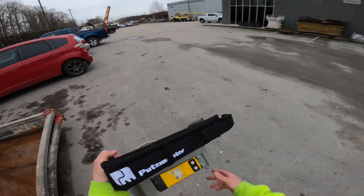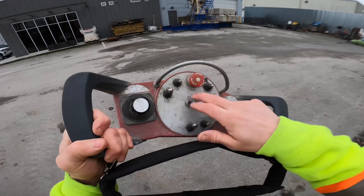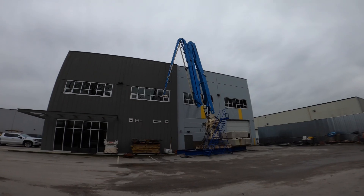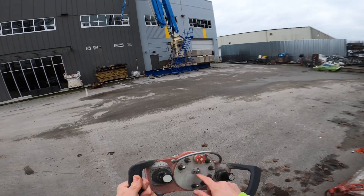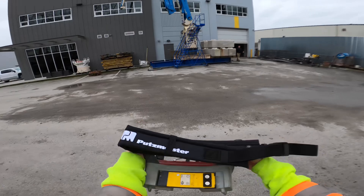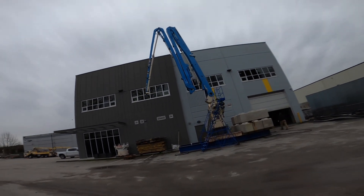I love these HBC remotes — these things are bulletproof. But what I do miss: one of the old Omnex boxes had an LED light in the receiver, so you had an LED reference for setting these sections instead of doing it all by visual guesswork. The new Aircom remote — the Jackhammer remote they're coming out with — actually has numerical values on an LCD screen so you can tune based on those. I wish they had this on these HBCs. Aside from that, I absolutely love them and they've been really bulletproof for us.